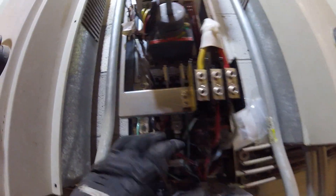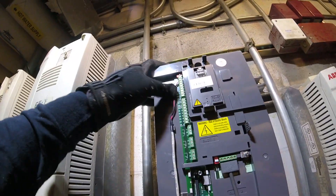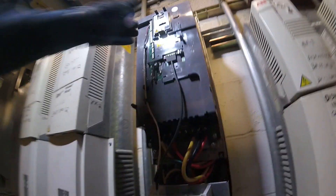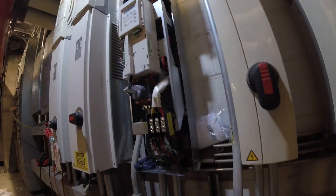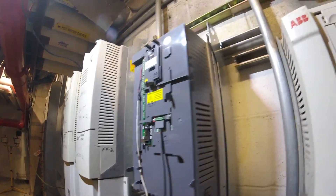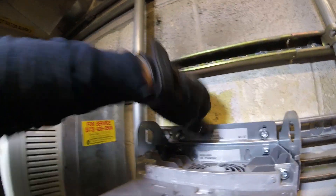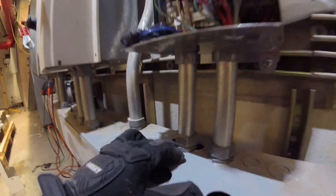Everything is nicely and neatly wired. This is an extension — everything's grounded, all the terminals are here, everything's run neat. Basically we were here just to mount it and replace the old one. The guys from ABB are going to come here to program it and start it up. We also installed the Kindorf in the back to support the top. The bottom is supported on this Kindorf. We had to remount these holes to get it going and that's pretty much it.